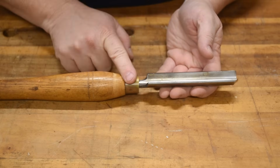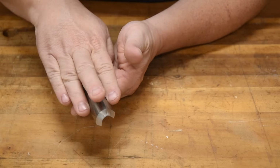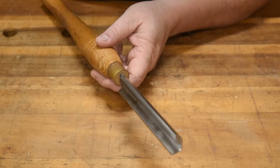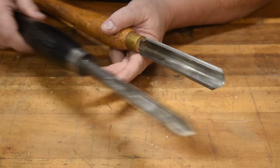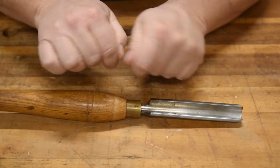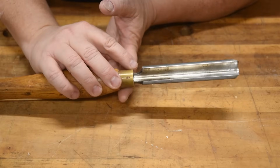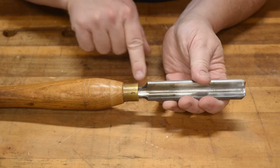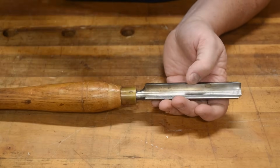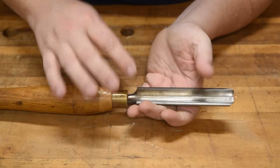And the weakness of this tool is in this shank, because how they make this tool is they take a flat piece of metal and they basically roll it around on a press and then just stick that flat piece, the part that's still flat, into the handle as a shank, as opposed to something like a bowl or a spindle gouge, which is a solid bar. Now, why is that weak? Well, if you've ever taken a can, you know, you flatten it and then you can bend it back and forth and it will snap in half. But if you're bending it before you flatten it, it's a lot more resistant. So this is that tin can in the flat portion, and because you've got it curved here and the rest is in the handle, all the torque happens right there, and just repeatedly using it, it will bend on you, weaken on you, and eventually break. But if you're just using it very easily, going across a grain, as it's designed for, there is so little stress, this will last you a lifetime.